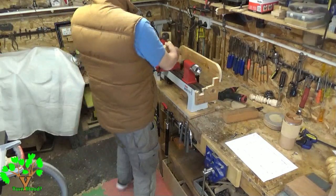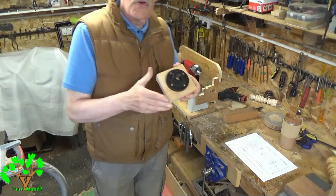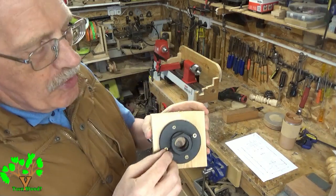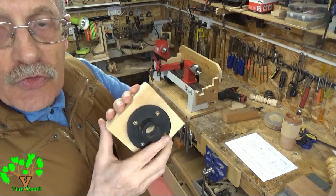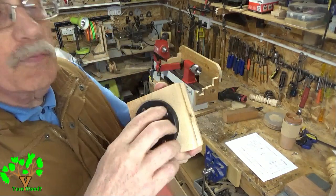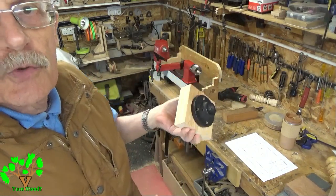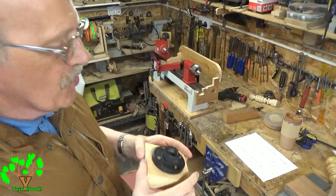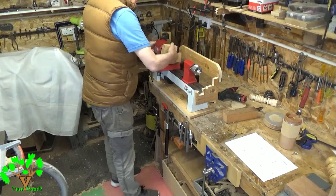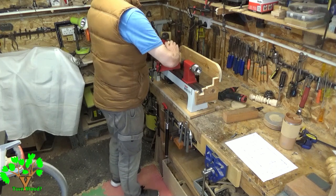Right, as you can see, there's 2 screws on the back here, so if we want to put the motor in reverse, this faceplate would unscrew itself off the thread of the headstock. So there's 2 little grub screws in there which we can tighten up and stop it unscrewing itself no matter which direction we send the motor, whether it's reverse or forward. But we're okay at the moment because I'm not going to put the motor in reverse. Well, on purpose, that is.